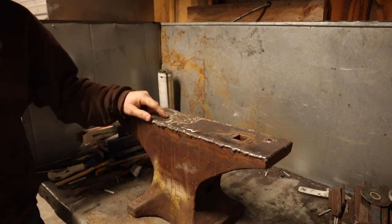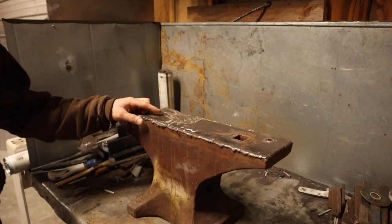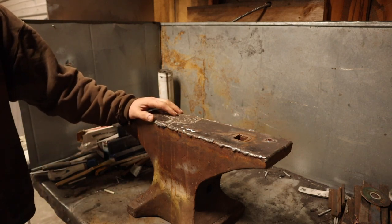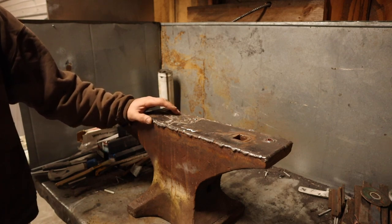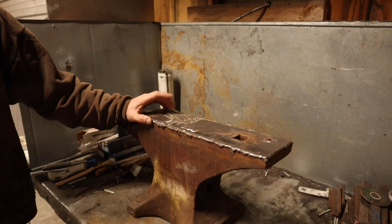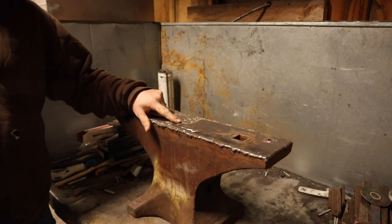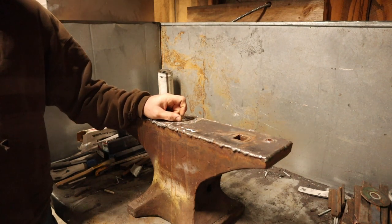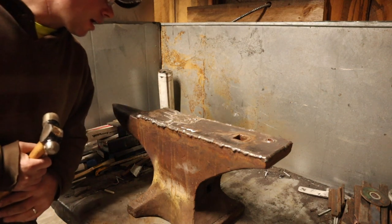hard alloy 58, and I'll tell you what, that stuff is no fun to strike an arc on, I found, and that's after heating the rod up. They recommend 100 amps for this. I have the options on that old Lincoln of either 90 or between 90 and 115, or they recommend 110 amps, excuse me. So I'm running it on 115 amps. That's the closest number I have, but I'm not really burning into the face too much. This is just a layer, but I noticed that this rod is a pain to get going, and it likes a longer arc than anything I've ever used.